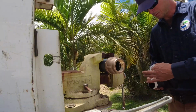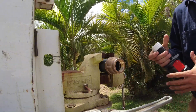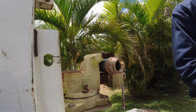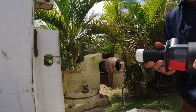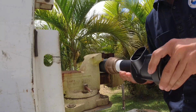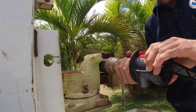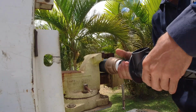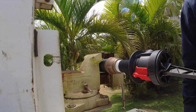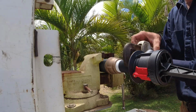We're going to be changing out the customer's solenoid valve for one of these. Another nice perk of these differential valves is just how simple they are. There's no electricity required to operate them. They just go onto any NPT bulkhead fitting, pipe thread fitting. You can get them 1.25 inches, 1.5 inches, 2 inch, and yeah, just incredibly simple to install.